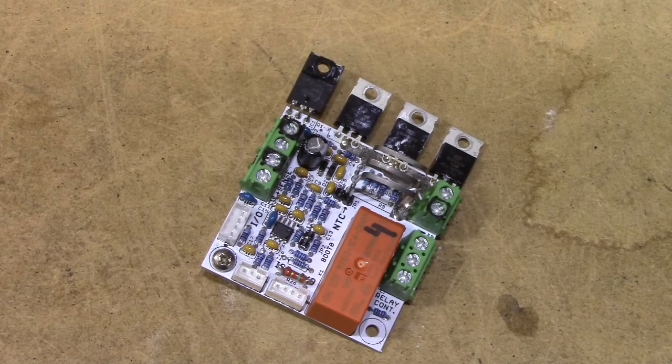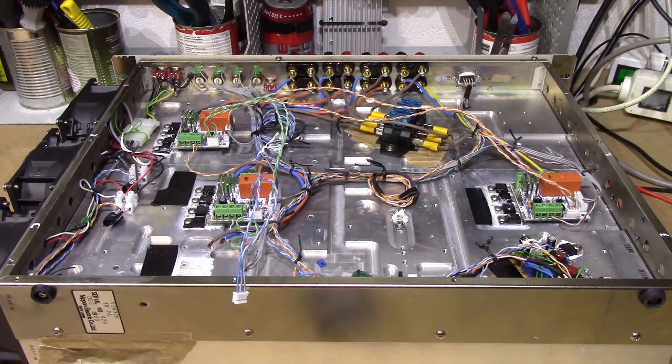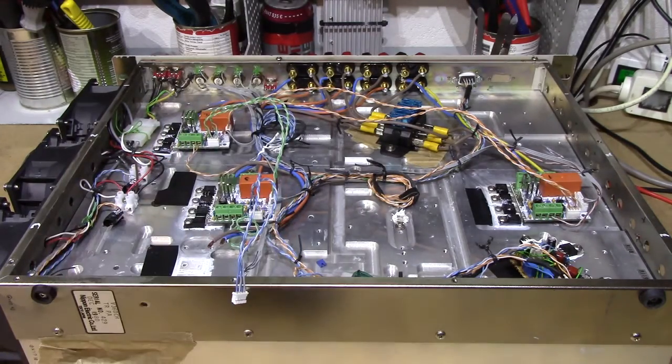So we are just running with no external load resistor — we just have these current shunt measuring resistors in series. Now I'm going to mount this board back into the box and get on with actually calibrating them. Just yesterday we got a working firmware up where we can actually save the calibration data into the internal EEPROM, which wasn't possible before — so any calibration done was lost every time we rebooted the unit. We also have the voltage meter working now, which it wasn't up until yesterday, so I can calibrate the voltmeters on these units. The reason this board is out is because the voltmeter wasn't working due to a bad solder joint on the op-amp, but that's remedied now.